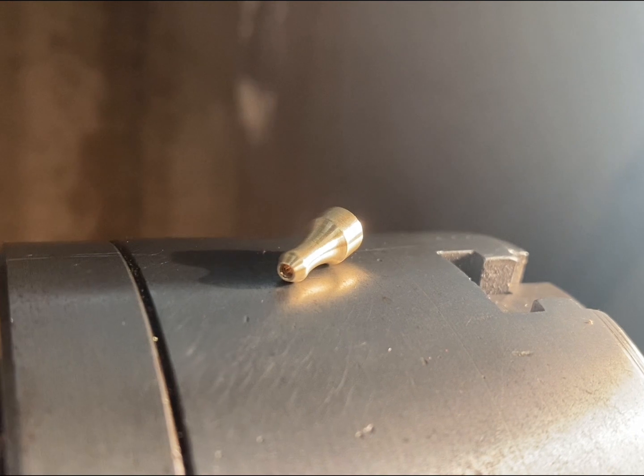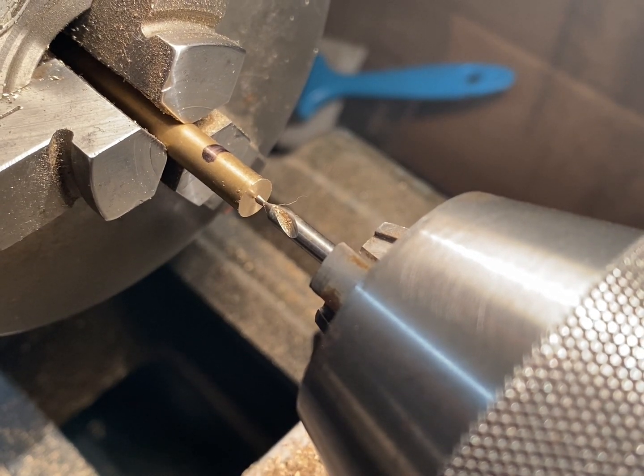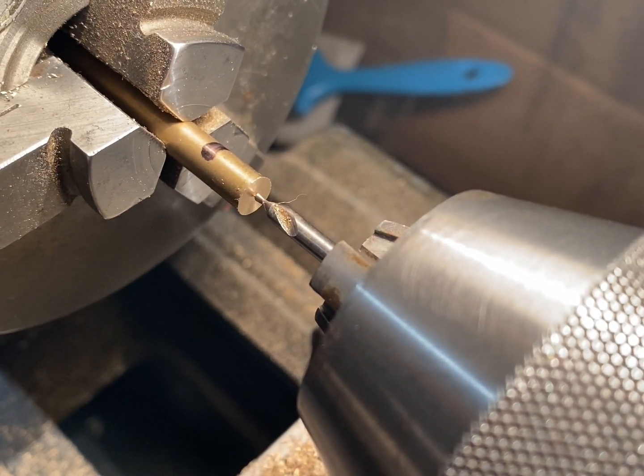That's the oil pipe tip complete — it's time to move on to the plunger rod piston. To make the plunger rod piston, I've already refaced this piece of stock brass. I'm about to centre drill it, final drill it and then tap it.